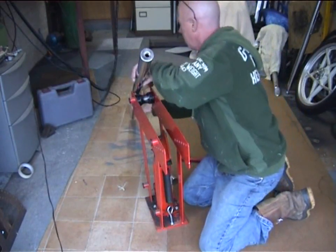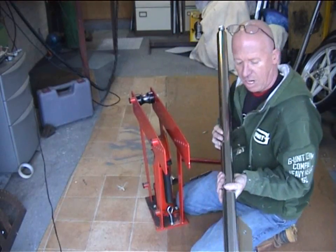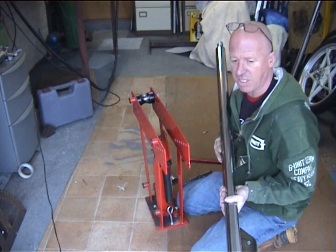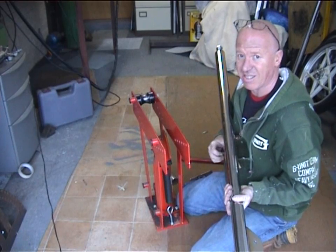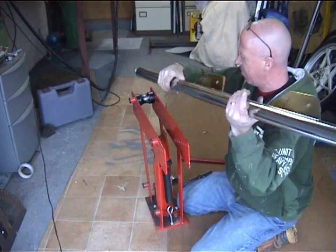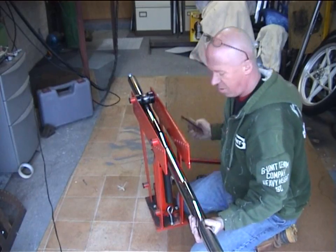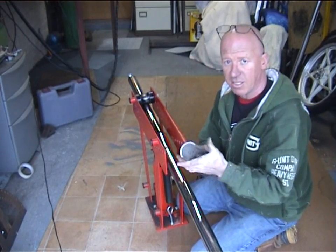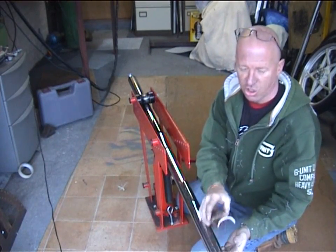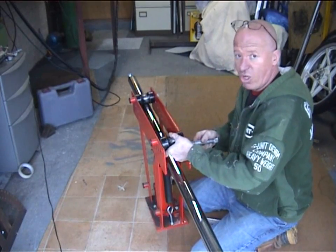Here we go. I can't tell you exactly how much to bend it or how much pressure to put on it, because every weld is different and every piece of stainless is different — it's more about feel than anything else. We'll slice this in, put these guides on — they're just a piece of 60mm stainless tube, 5mm wall — that sits nicely on top. I use these to stop the rollers from denting into the stainless, because it will dent.